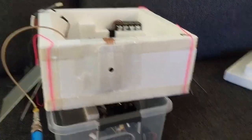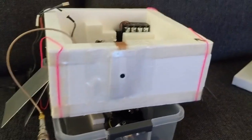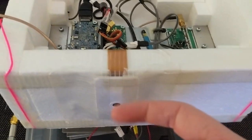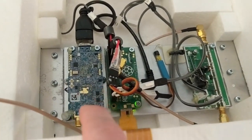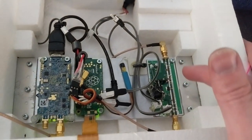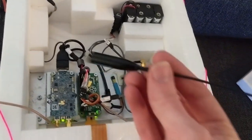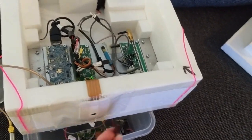On an upcoming Project Horus high altitude balloon flight, we're going to finally fly a live video payload. That's this box here. What this contains is a Raspberry Pi Zero W which is capturing the video from this camera here and compressing it. There's a LimeSDR Mini which does the modulation and the production of a DVB-S signal on 70cm. And then the amplifier here which produces just a little bit under one watt of output power, which will go into a handheld antenna underneath the payload.